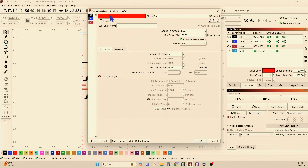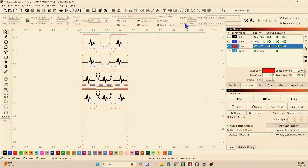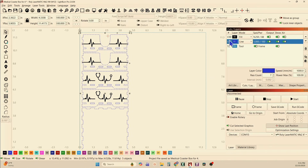If you look at the red layer, you can see I have it saved with a 0.1 millimeter outward kerf. But if I look at the 01 blue layer, the kerf is off — zero kerf. I'm using the Rolly 10W, and that is a really good fit, makes it really snug to assemble. If you don't want to mess with kerf at all, you can simply select everything on the red layer and move it to the 01 layer — now it's all on one layer with zero kerf. That simple.